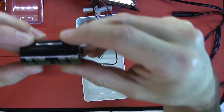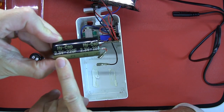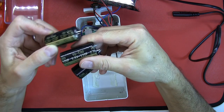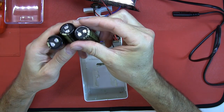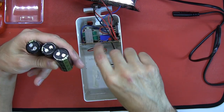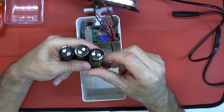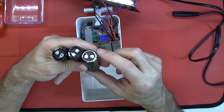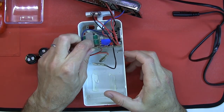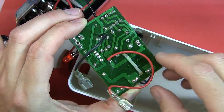I've dug out my hybrid capacitors — they're rated at 2.3 volts at 220 farads. I've only got three left; the rest are tied up in my Kindle project. I'm going to carefully link these in series and charge them to just under their rated voltage, then connect them up and see if they'll operate this light and how long they'll last. Before connecting them up, let's have a closer look at the PCB.